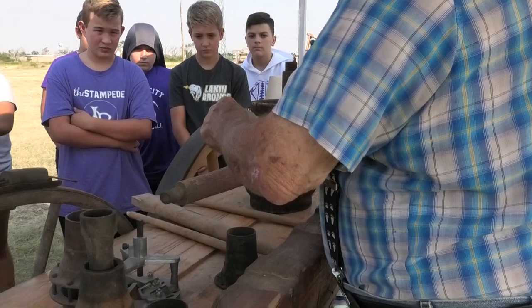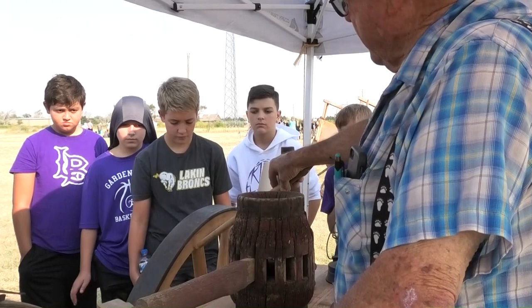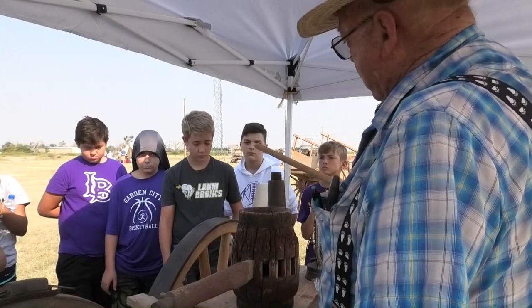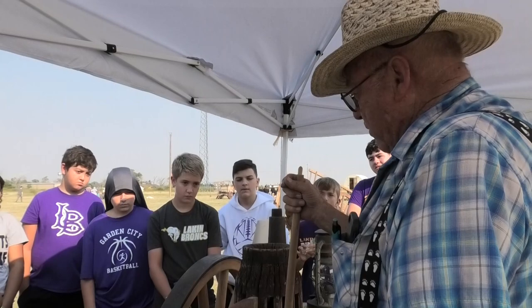So now we start to work with the fellies. The wooden part of the wheel is called a felly. And some people lay the spider on top of the fellies and measure it that way. I don't do it that way. I'm a perfectionist, is what's wrong with me. And I mathematically locate those spoke holes. Drill the holes. Now, we've got everything ready to go.